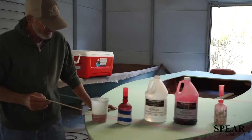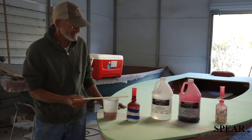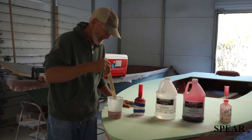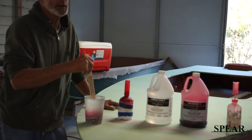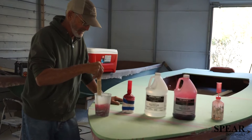I've got 300 milliliters of resin right here, which is a Vinyl Ester AME 1001, and I've measured out 6 milliliters of Cat 11 — that's 2% of 300. I'm going to put that in the resin and then stir this way past when I think it's mixed, because it mixes at a molecular level. I like to stir it at least 100 times when mixing just to make sure that at the molecular level it's really well mixed.